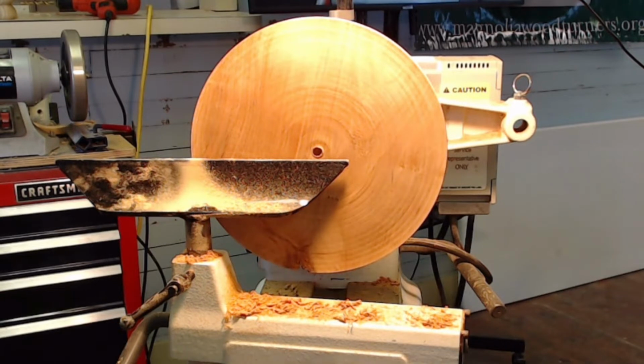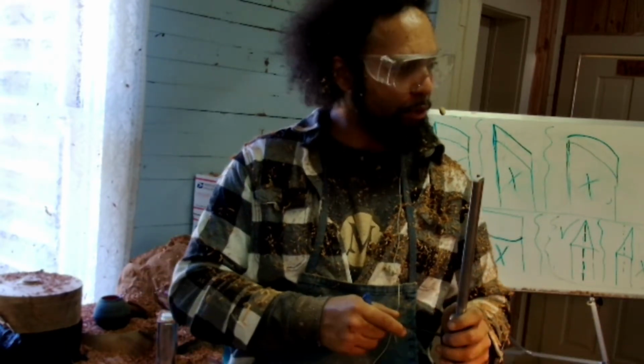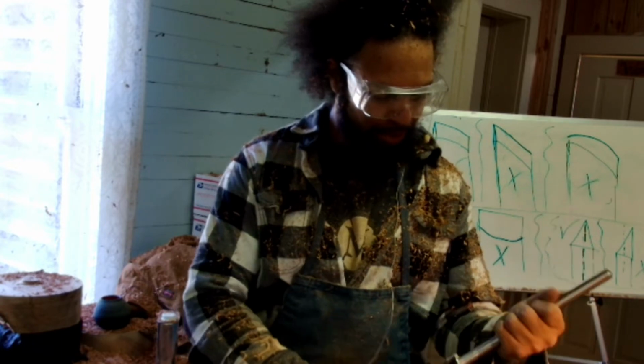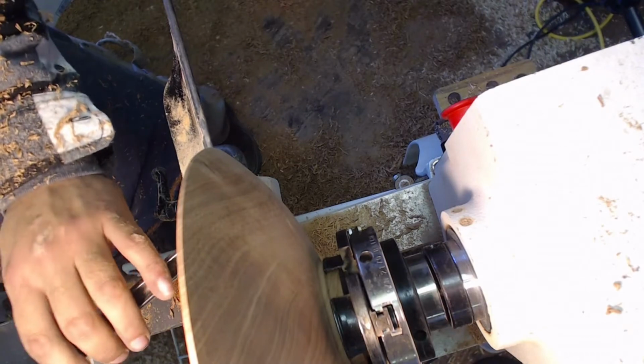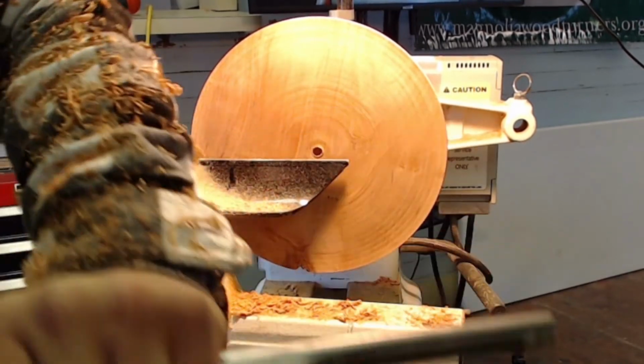Now, this is going to be a half-inch interior ground tool, and we'll do that. This is ground to about 60 degrees, okay? But there's a secondary bevel on it that's ground at about 40 to 45. What that does is it means that at the initial point of making that cut, I can start at a typical 90-degree plane right here. If I have a 60-degree tool at the very outward set portion of the face, I usually will have to raise the tool up a little bit higher like this so that the cutting edge can actually cut. If I sweep the heel back pretty extreme, at about 40, 45 degrees, that's what I'm looking at.